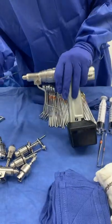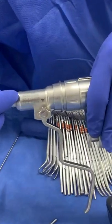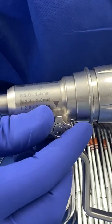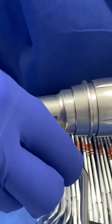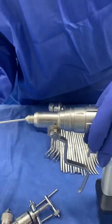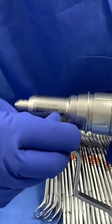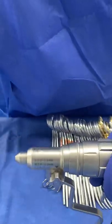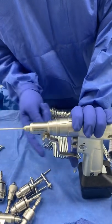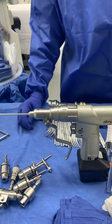Put a pin in — make sure you have the right size. As you can see, some of them are adjustable. This is the size on the side of the drill, so check with your wire before you put it in. If you put it on the small one, this size pin won't go in. So we're just going to change it to medium. Slides in, and then give a check by pulling on the trigger, getting a tug on the wire — make sure it's not going to go anywhere so you have a secure fit.